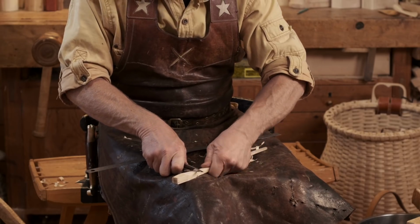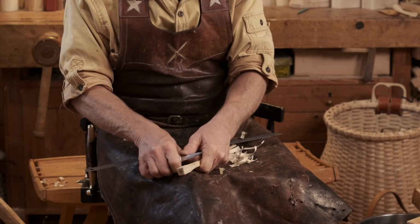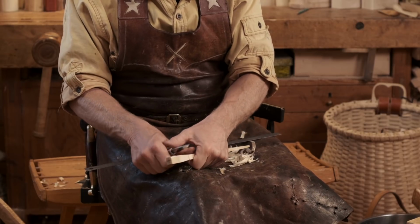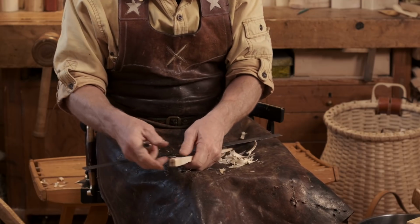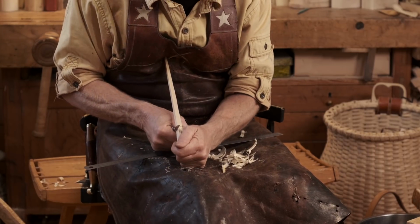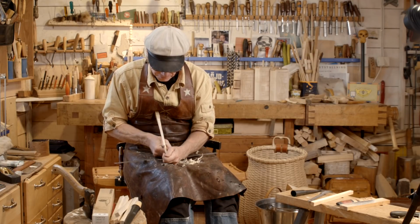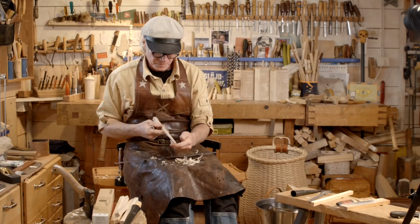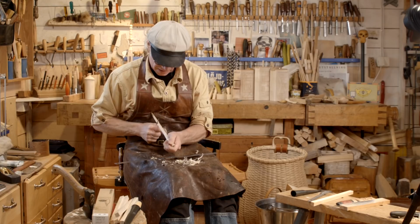So I'll make a 90-degree cut here directly down into the wood, and then I'm using the crossed thumbs to make a V cut, which will give us the very end of this chopstick. So this is how long it will be. Now I can start to trim the sides, make it smoother, make it flatter, and remember to flip it as soon as the fibers are running in another direction. It's still a little thick here, so I'm going to trim it a little more on this side.